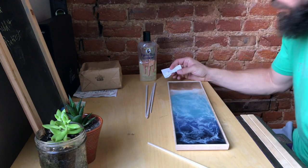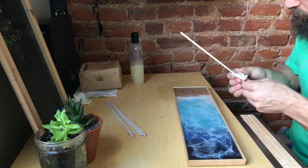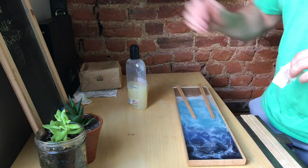I use a chisel to taper the ends to give a little visual interest so it doesn't just come to a square end. After sanding to clean up the faces and corners, it's time to throw on a coat of finish — and boy, this thing started to pop. The curly maple looks great with the ocean pour and the chopsticks look fantastic on that sushi board. One thing I do want to address: epoxy is not FDA approved for food safety, so I did a final coat of shellac on top of the epoxy to create a safe barrier between the plastic and any food contact.